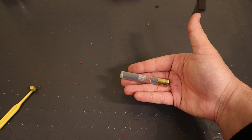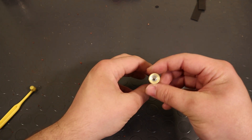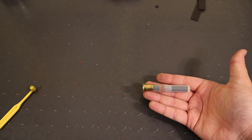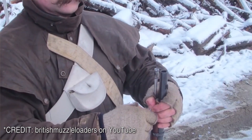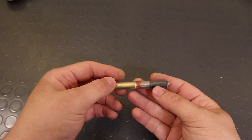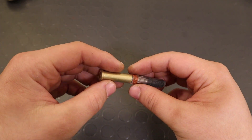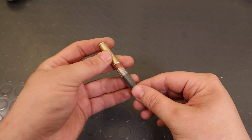As I anticipated in the first video, the best solution was to use a proper casing to hold everything together, which required a purpose-modified barrel. However, it's still possible to use a uniform bore if a very thin casing is used, as in the paper cartridges of the 19th century. But since we are in the 21st, I went for heat-shrinkable PVC plastic, which I thought was the most convenient. These cartridges work fine and don't require a purpose-built barrel, which is why I'm going to be able to fire them today in an already existing gun.